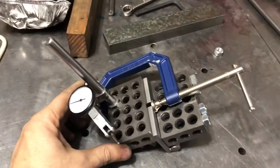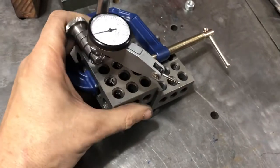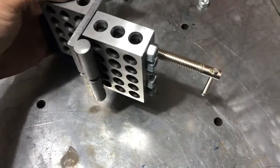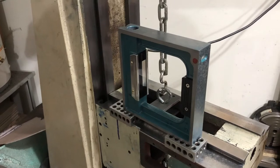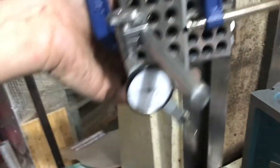This is my copy of Nick Mueller's Dovetail Alignment Jig. You can see it's really just some one, two, three blocks with a dowel pin that I brazed in on some plates. Got the flat sides scraped in on my surface plate, and so let's see how they line up on the actual mill itself.